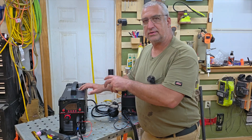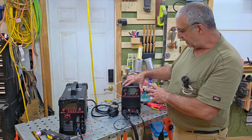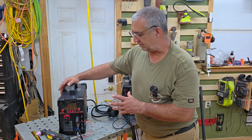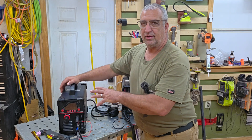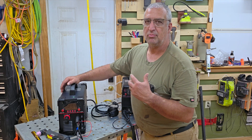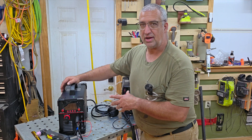We've got the Arc Taylor 75-amp machine here. I did a review on the 55-amp machine and it's a pretty good machine. The 75-amp machine should be able to cut three-quarter inch without too much of an issue. That's what you'd want if you're cutting thicker plates or doing high production where you're moving very quickly — you get the extra amps, and that's where the 75-amp machines come in.